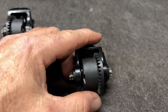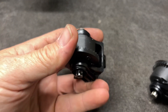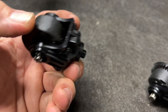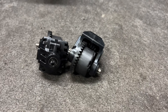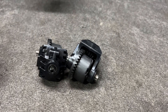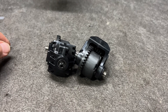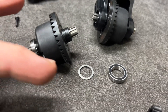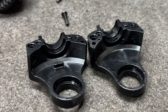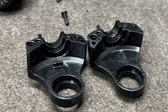This one I actually adjusted the shims so it would flow freely. This particular one I'm about to open up to show you guys the shim stack - it is kind of tight. I'm going to adjust the shim stack here. I'm not planning for big power for this thing, not doing any speed runs, just nice simple laps around the track. That diff had three shims over here, this one only has one - I'm going to move that one over. See that little notch right there? That keeps you from putting the ring gear on the wrong side.